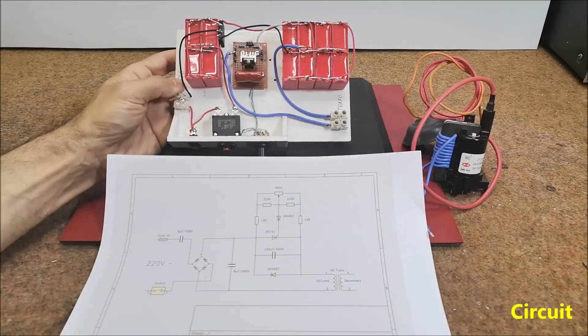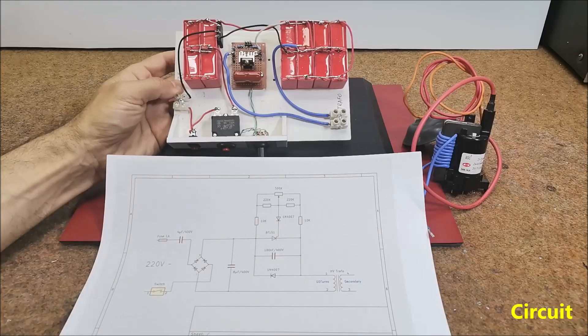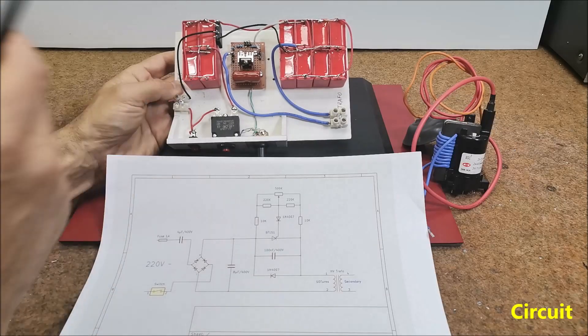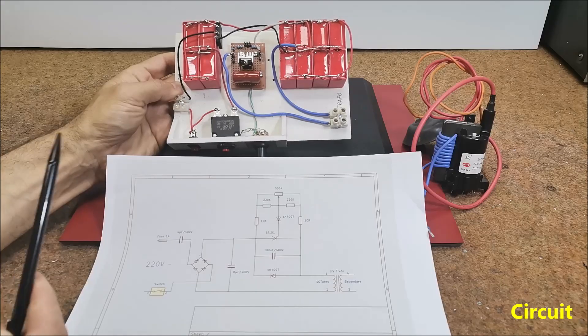Let's explain the principle of operation. At the input of the circuit we have a switch and fuse or circuit breaker, then a series connected MKP capacitor — in this case with the value of four microfarads. This capacitor limits the current in the circuit; if we double its value the current will also double, but in this particular practical case its value should not exceed eight microfarads for the sake of safety during long-term continuous operation. I chose the lower value of four microfarads.